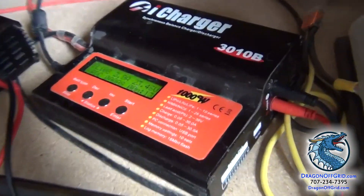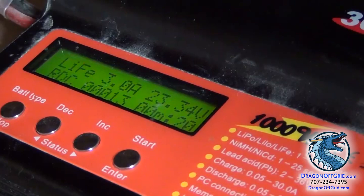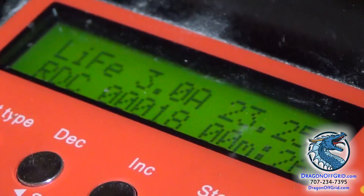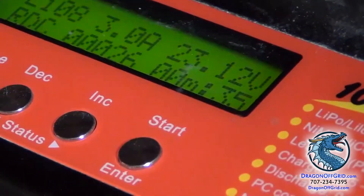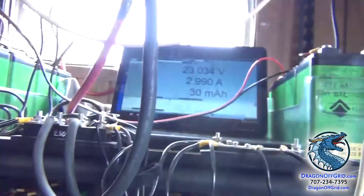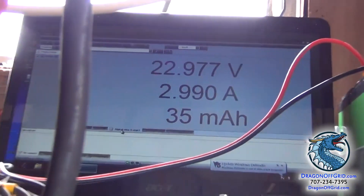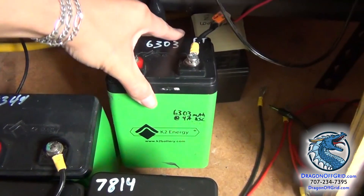Since the battery was drained, its voltage is already low. Normally you'd see the battery around 26 and quickly get to 25 during the discharge test. At the end of it, it'll say done, and it'll have you a reading there. Most of the time these batteries will cut off at the low voltage, and I have it drain all the way so it does cut off to make sure I get a full capacity reading. That is the main reason to have a computer attached — the screen cuts off and you're not going to have a reading on the charger screen. But if you have it on the laptop, you'll have that reading right there. And that's how I test the capacity of these K2 Energy lithium batteries.